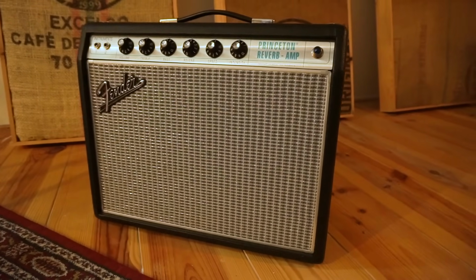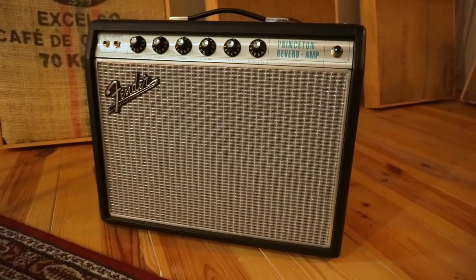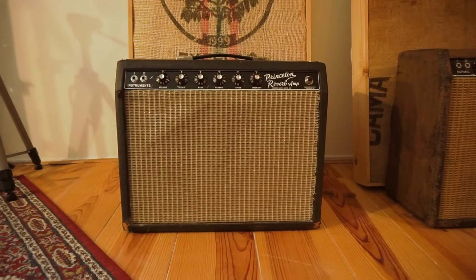I'm Aldo Spadaro, and in this video we're going to do a very user-friendly, non-intrusive modification to a Fender Princeton Reverb reissue amp to make it sound better, or at least a bit different, and then you can decide after the short A/B comparison we will do later in this video which you like best. Obviously you can do this modification to any guitar amp that carries a 12AX7 preamp tube in the first stage, or let's say a 12A type of tube with a 9-pin layout.